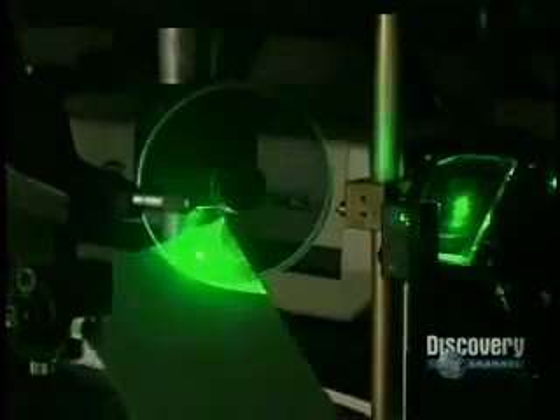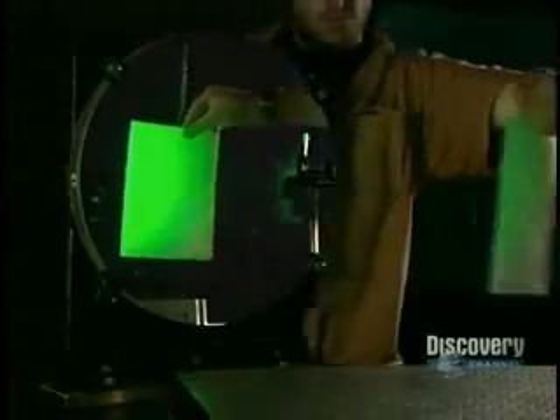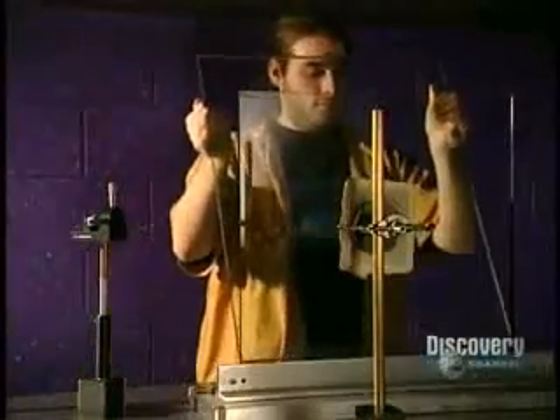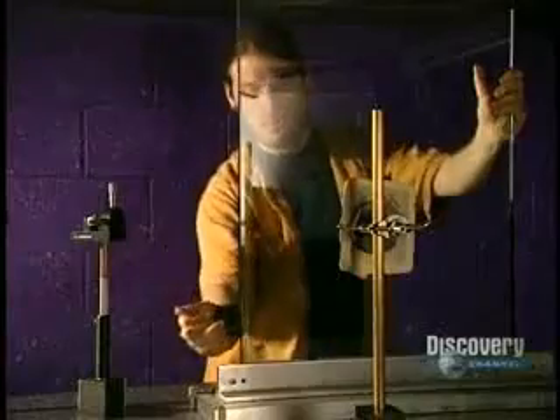The beam splitter separates the beam in two, directing one behind the object and the other in front of it. One part of the beam heads toward the front of the sculpture. The beam first passes through an objective lens that diffuses the light, then it's reflected by a parabolic mirror, which prevents it from losing too much of its intensity. As in photography, film is required. This holographic film is attached to a glass plate with adhesive tape, then another glass plate is added so that the film will not move. A vibration of one-tenth of the laser's wavelength is tolerable.